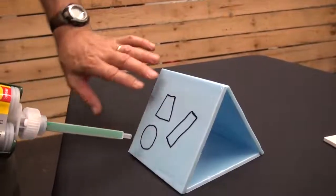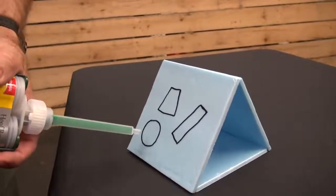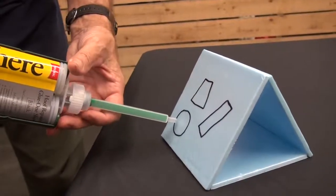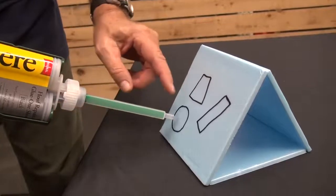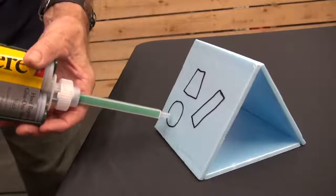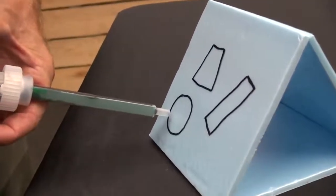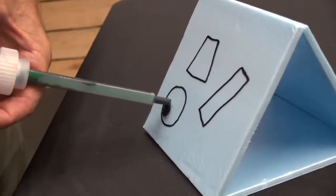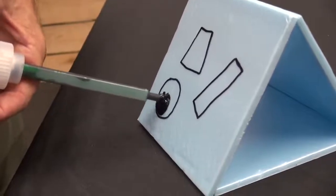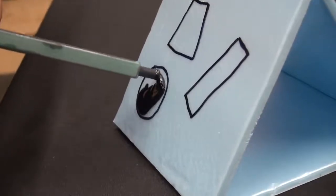All right. So when we're working on a fairly vertical surface, the importance of the three things that we talked about earlier still hold true. We want to hold it off the surface a little bit. We're going to be 90 degrees from that surface, and we're going to use a stirring motion. The difference here is when we're on a vertical surface, we want to move much more slowly. So we can stir material to keep it from slumping, and as long as we keep stirring, at some point, maybe about 30 seconds in, it will stop moving.